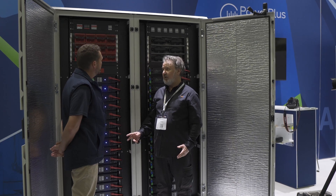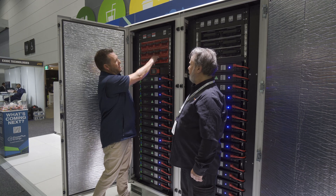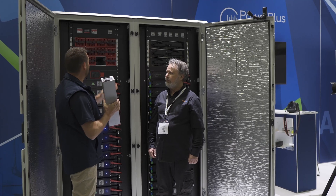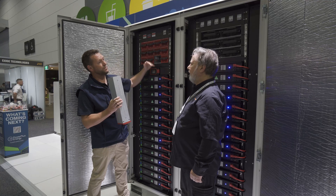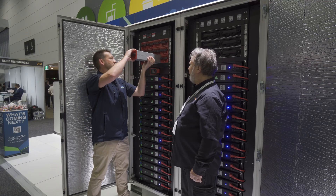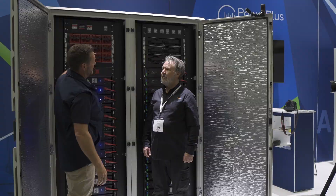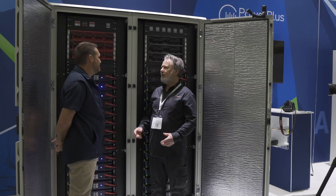28 kilowatts three-phase, I presume? Correct. You can do three-phase or single-phase — this one is a three-phase system. They're a modular hot-swappable solution. You can simply grab one of the modules when it's in operation, take it out if you need to service it, and all the rest of them will keep on operating. The rest of the inverters in the phase will pick up the slack. Once you get a replacement, you can simply slide the unit in — no need to reprogram it. The cluster will automatically reprogram that device and the system's ready to go.